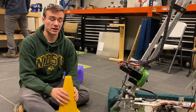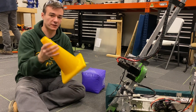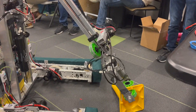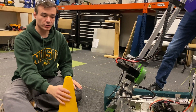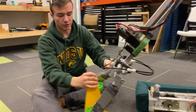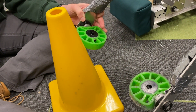We're going to do an overview of our pneumatic grabber and the mechanism we have to grab both the cones and the cubes. One of our goals this year was to figure out a way to pick up these awkwardly shaped cones from any angle, as well as being able to right them, because when you set them on the peg in the grid they need to be upright. Our grabber has a mechanism that allows it to rotate the cone based on gravity when you pick it up, so as you lift it off the ground the cone rotates upright.